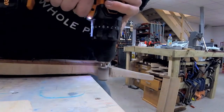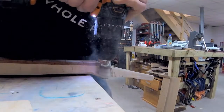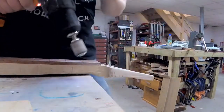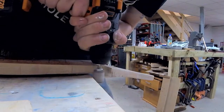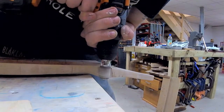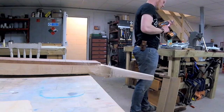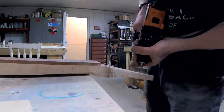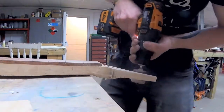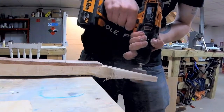Now, once again, because I have to stop saying once again, it's annoying me now. But because our spindle sanders and bobbin sanders were broken, I had to figure out a way to get into the smaller areas. So, easy enough, Tom actually suggested this little trick of taking just a normal drill driver and putting a spindle on it, or putting several different spindles on it to do the same job. This does take up a little bit more time, but it did do the trick.